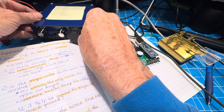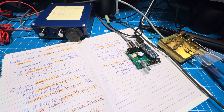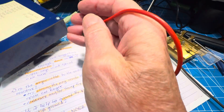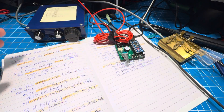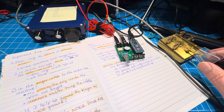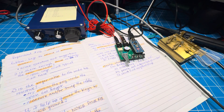Let's push the NorCal 40B out of the way a little bit and go through some of the questions that came up. On the NorCal 40B, the actual sidetone is a reflection of the received signal from the transmitter — the sidetone actually gets louder when you're putting out more power. So we can try that with the key, and that's pretty loud the way it is, probably loud enough to be heard through the recording.